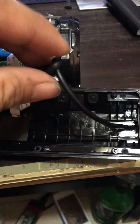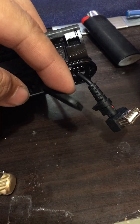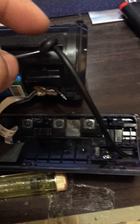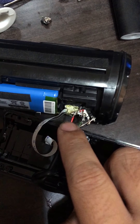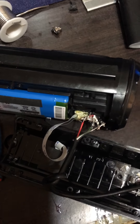Let me solder it up. Before you start soldering, make sure you have already threaded the wire coming from the back of this port here, and then try to make a knot so that it won't stretch out even if you pull it. So I got it soldered — red to red, green to white-orange, white to white, and black to black. We'll just wrap this up and test it out.